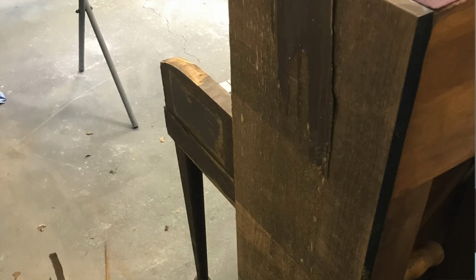For the most part, if it's savable, I want to save it, because I can either take the veneer up a little bit if it's not all torn up, clean under it with the sandpaper and re-glue it. You get good results with that sometimes. There's just all different ways. But on the big sides and a few other places, I did just remove it because it was in such bad condition. There was no saving it. Again, the paint job and all the materials that I use will fill nicely on that layer of the structural wood, and we basically do the paint job from there.